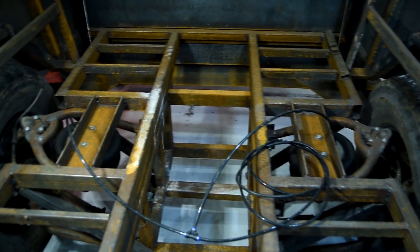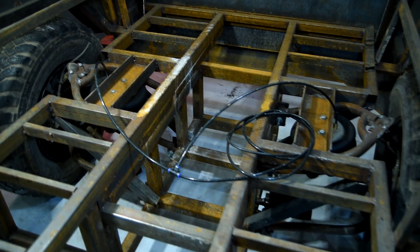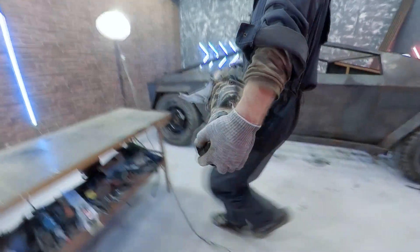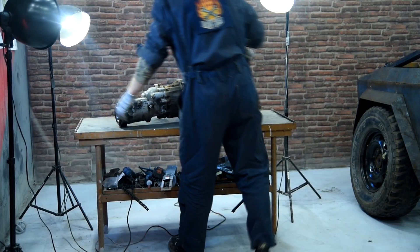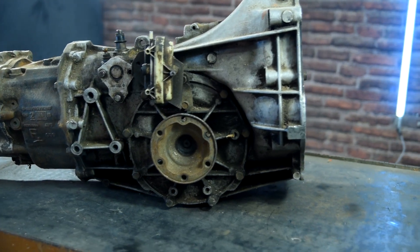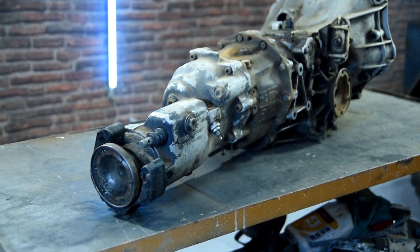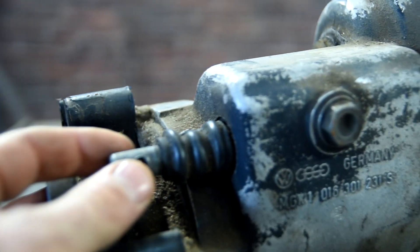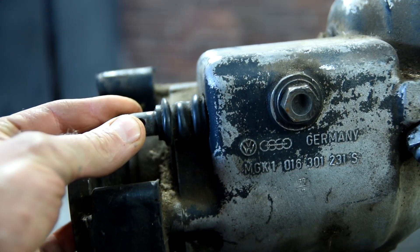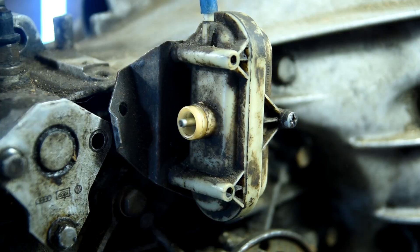Although I think I have a whole lifetime and will be able to get all these details eventually. In the meantime, I'm going to install a cheaper but also a very good four-wheel drive variant. Now I'll tell you what spare parts were used for this. Of course I took the gearbox with all-wheel drive at first. It has a drive for the front axle and also an outlet for the gimbal on the rear axle, which is connected with the help of this rod. It is controlled by an air-powered cylinder which is still in good condition, but I'll replace it with a servo motor so the whole thing could be controlled with a tablet.